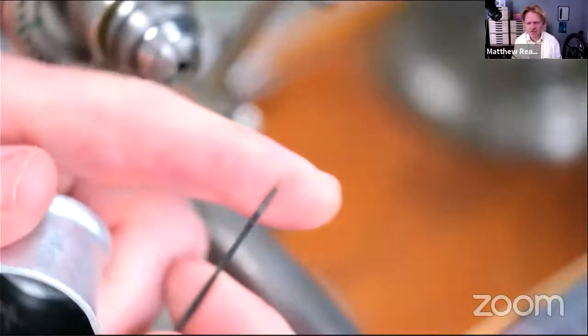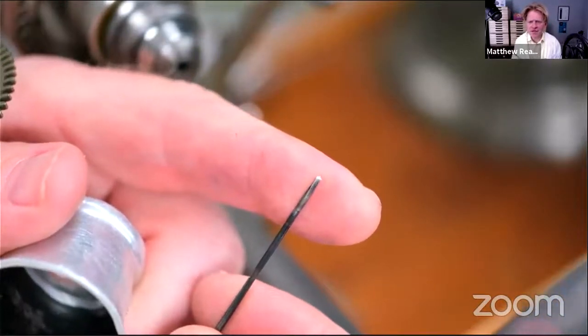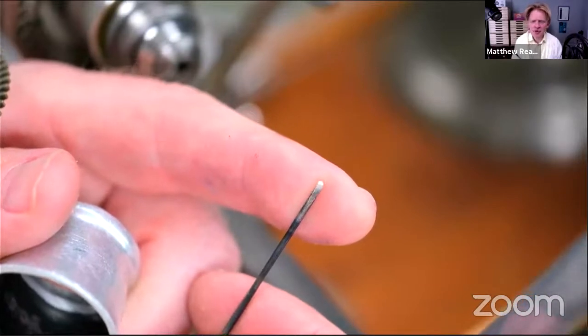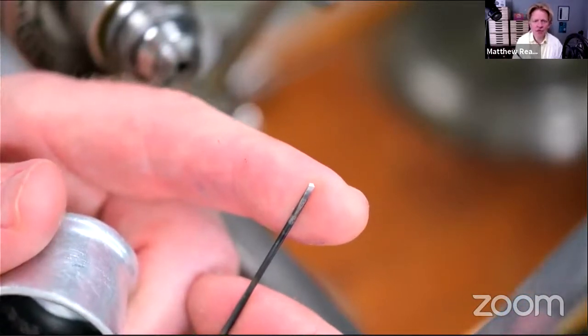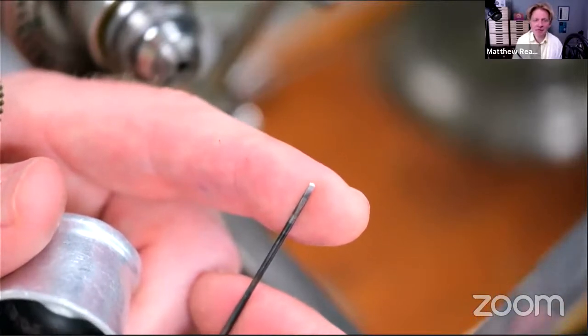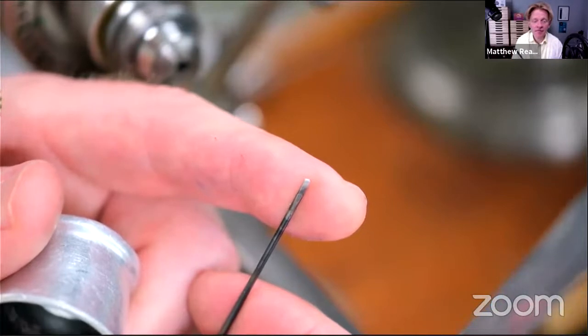Yeah, it's cool. But you can see there, looking at the drill, I mean, it didn't have a lot of work to do because the hole was already a millimeter diameter, but it is still dead sharp on the corners. It makes such a difference. When I tempered it back, I used the spirit lamp and it was the palest straw.